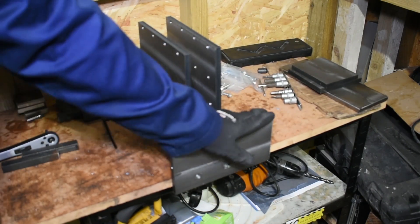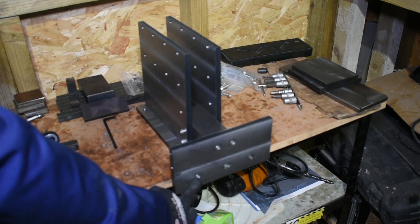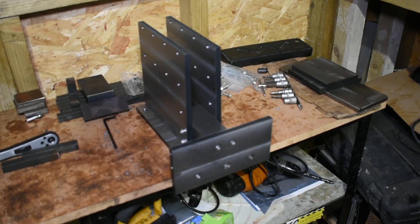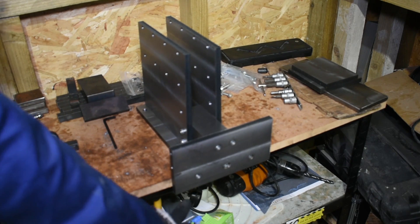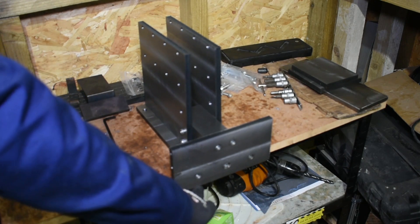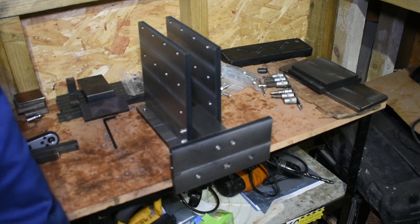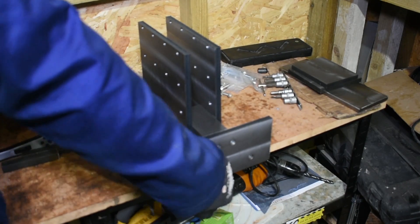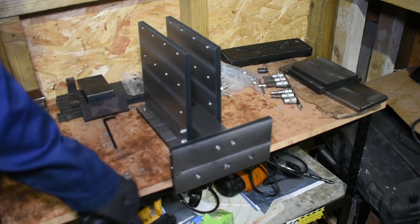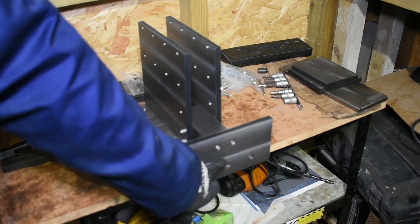There we have it - we've got the parts together that we've made so far. Some eagle-eyed viewers might notice that I haven't put a screw in here and that this hole is slotted. Unfortunately I made a few mistakes on the base plate when drilling that end. The first mistake was I snapped an M6 tap in the end of the plate, so I'm waiting for a solid carbide drill to try and clean that out and hopefully get it re-tapped. The middle hole on the base plate I managed to drill 2.5mm out of position - I think it was getting towards the end of the day and I just lost concentration. I've just about managed to recover it by slotting that hole and it works okay. That won't be seen too much because the carriage will slide just within that portion and it will probably be covered all the time.